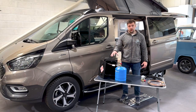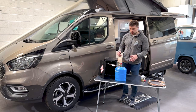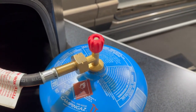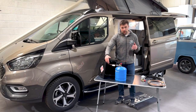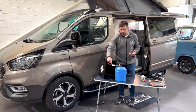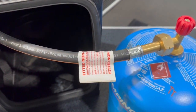This is a perfect solution for any permanent gas fixtures inside your van. It's the most safe and reliable way to do it, and the reason being is you've got two points of regulation. The gas adapter on top acts as an on-off tap, and then you've got the regulator inside the locker itself. Also, the butane hose is a very strong and durable hose that comes down to the extra housing it has around it, and the manufacturer-fitted connections on either end of it are much stronger than your jubilee clip.